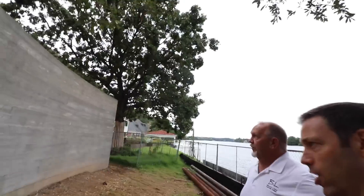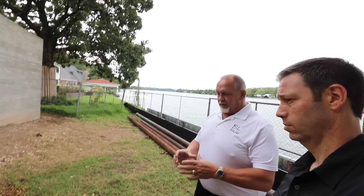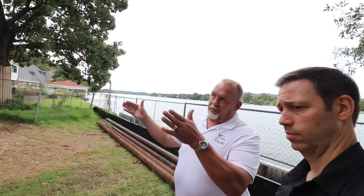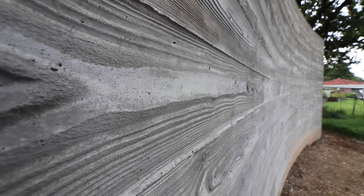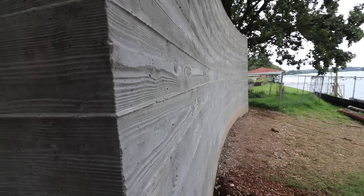Is this the same as the other one — you've got a curve and insulation in between the two? This one didn't need to be insulated because we have an air gap between the structure and the living quarters. On the other two, we have windows actually in the concrete floor — a block out done with Koya blocking. We're using counter flashes that we'll saw cut in, and everything will line up with all the wall lines. I had my framer come out, line up all our walls, get everything exactly where it's going to be so we knew exactly where we had to be for the windows. Who's the architect? This is Jim LaRue. Look at that grain pattern — it just makes you want to touch it. It's very tactile. Clients absolutely love it. And can you see the curve too? It's slight enough, but pretty enough — it's beautiful.